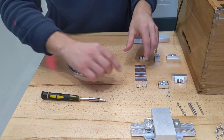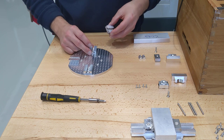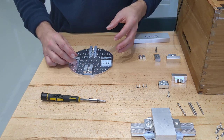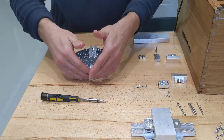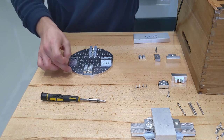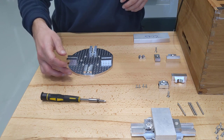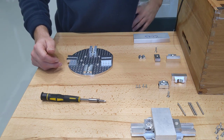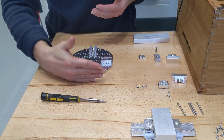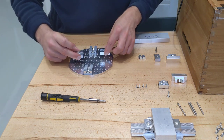I'm about to demo with four clamps. So long as these fit within this circumference, they're fine. If they sit outside like that, then you'll have a collision — that's basically the rule. I've left two millimetres clearance on the outside of this circumference of this circular plate. Anything overhanging when the table spins like that could hit the edge of the Pocket NC's B table. So long as it fits within, you're fine.